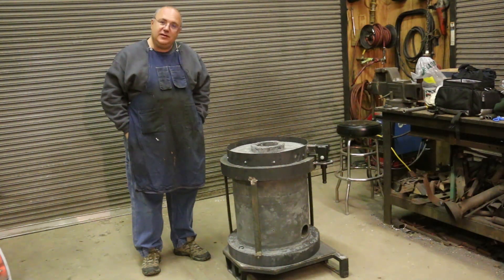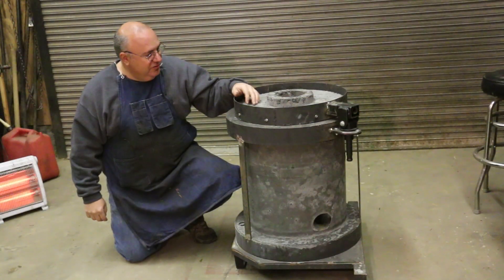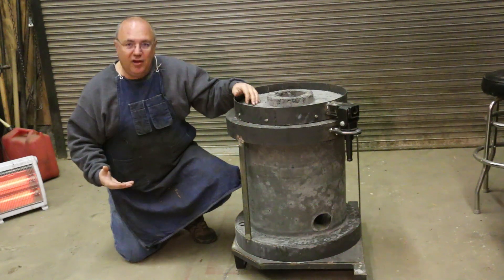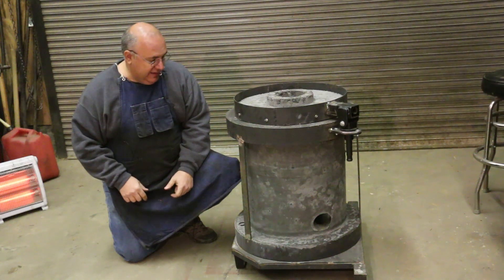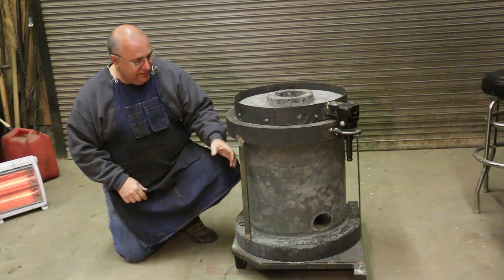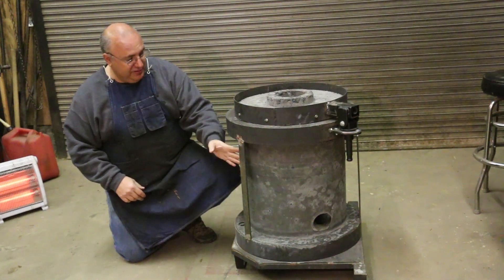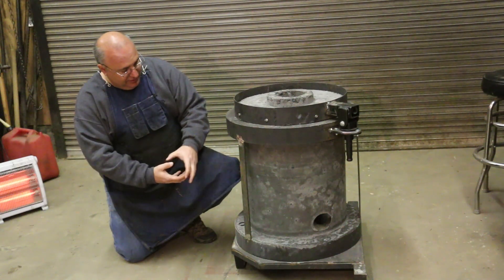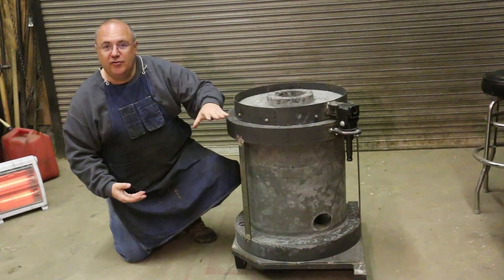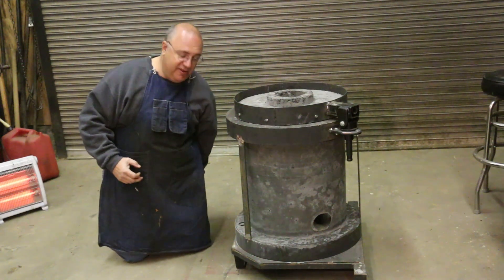Let me get you zoomed in here. I'm going to discuss a few things that have come up and what we're going to do to get around them. I try real hard to read all the comments on my videos and respond to as many as I can. When I did the last video and put these support legs in, several of you commented that I was making a big mistake — because as the furnace heats up, everything will expand and this chamber is actually going to grow. If I put these supports in here, they can constrict it and cause a failure.